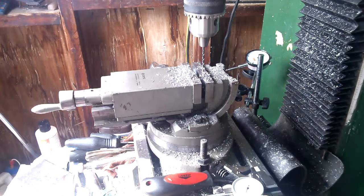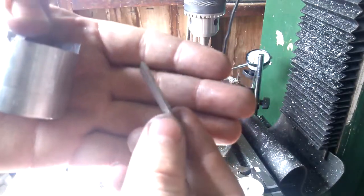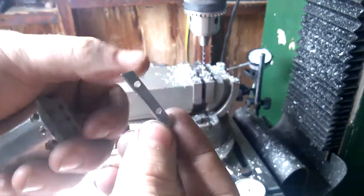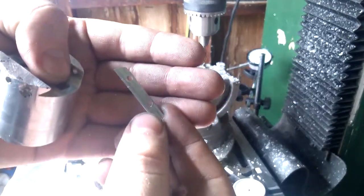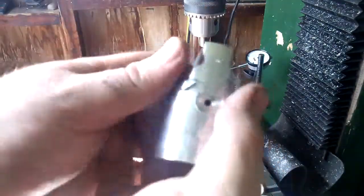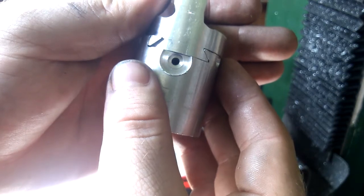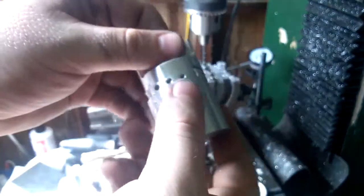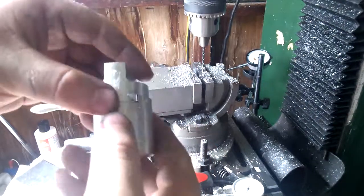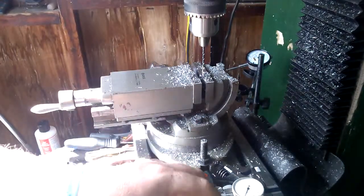The camera ran out of memory and I just finished this up. You can see — although the camera has a tendency not to focus — I had to do a little bit of filing on it to make it fit properly, and these edges aren't quite as clean as they should be since I just bandsawed and filed them. But you can see it sits in there rather nicely. It's not quite finished yet, but it does allow it to slide fairly easily, and with a little work it'll slide a lot easier. So that's the gib, and you guys have yourselves a good day.